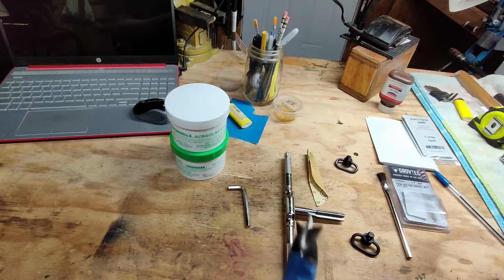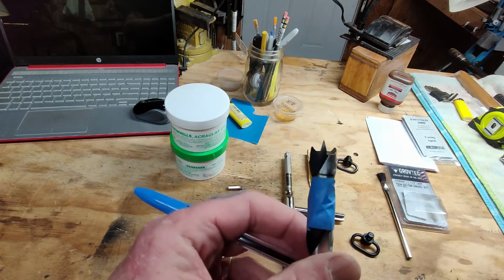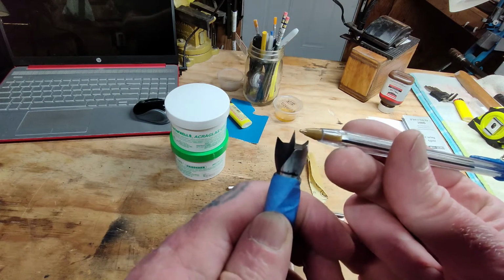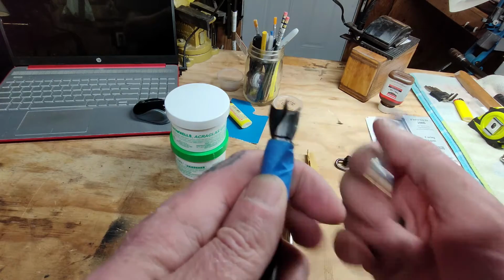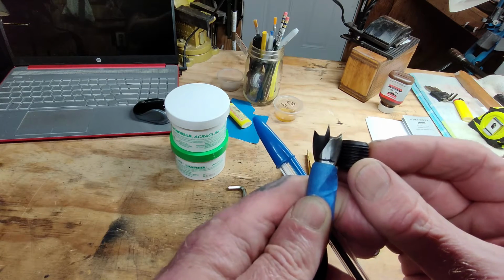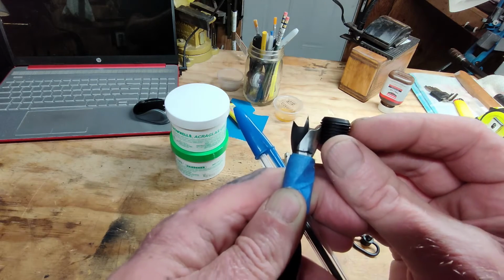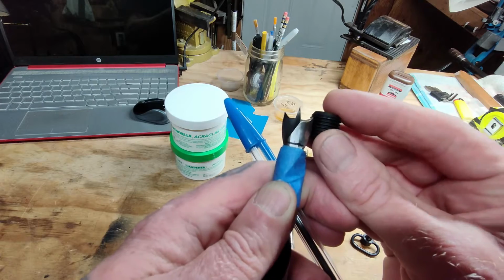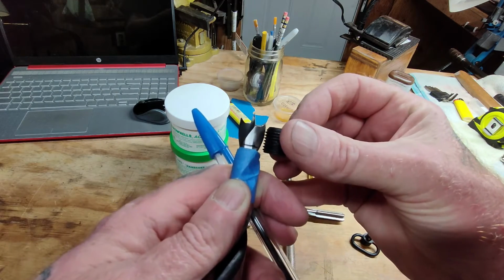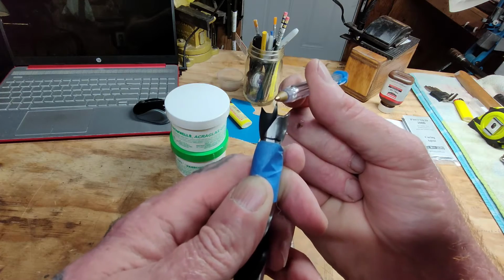So the next thing you want to do is prep your drill bit, and you want to mark it for the depth that you want to go. I'm going to illustrate with a pen here once I get this in my hand. The cups have a certain depth, and the drill bit has a center tip, and it's also got these cutters which make it cut into the wood real fine. You want to compare the bottom of the cup, and set your depth mark so the bottom of the cup matches that inside flat on the face of the drill bit. Otherwise, if you mark it like this with your tape, you're not going to drill deep enough, and you're going to end up with a portion of the cup sticking out of the wood stock. So what you want to do is put your tape so that it matches like that. You want this flat in here to be the bottom of your hole, not the tip or the cutting edge.